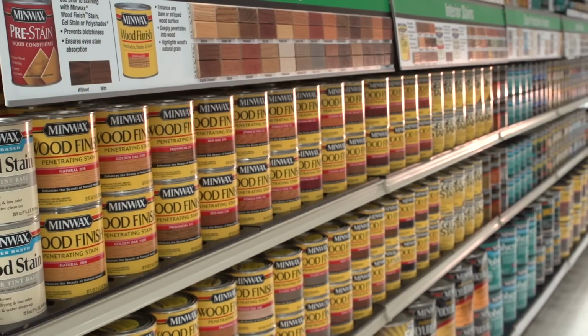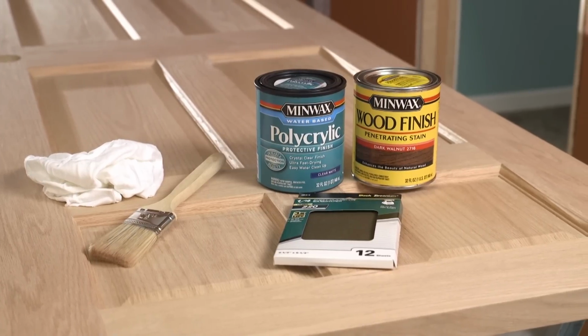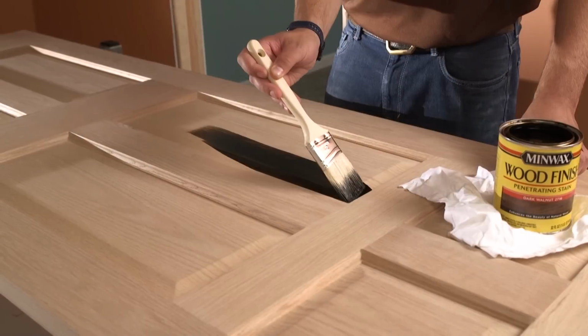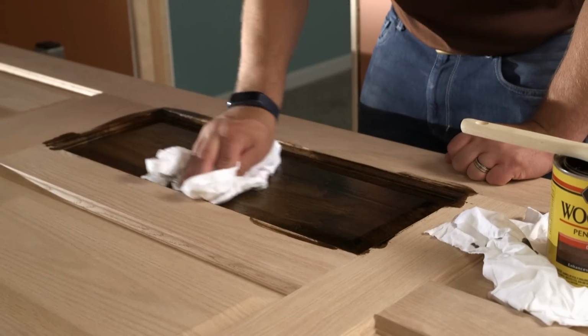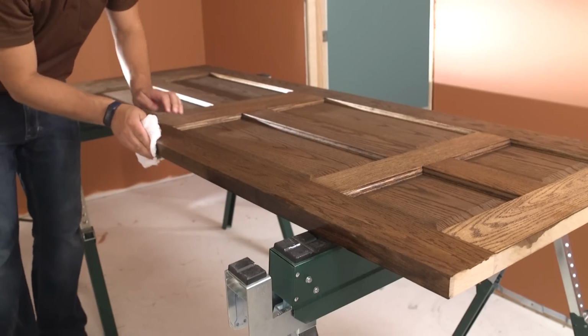The wall coverings department at Menards carries quality products needed to finish your new interior door. Make sure to sand your door and then wipe off before finishing. It's very important that the first coat you apply is an oil-based product. Apply a minimum of 2 coats of sealer to all 6 sides of the door. Carefully follow all paint manufacturers' preparation and finishing instructions.